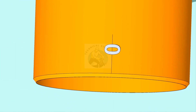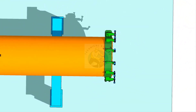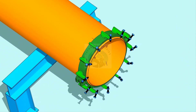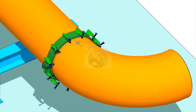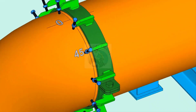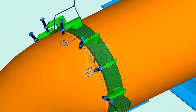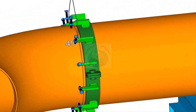Put the pipe clamp on the pipe. If you don't have one, watch my previous videos for how to make a pipe clamp. Put the elbow on the pipe clamp, making sure the marked end is near to the pipe. Arrange proper supports below the elbow. Put the gap rod in the joint. Now slowly rotate the elbow until the 45 degree mark comes opposite to the 0 mark on the pipe.